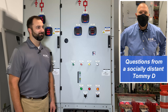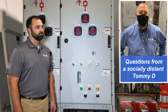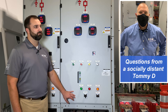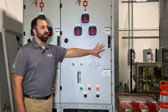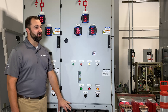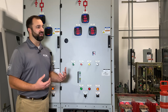We talked about the doors, the entry and exits. The doors down on the bottom of this equipment are open right now. The door that's up top — is it interlocked? The low voltage door up here can be key locked right here. There are no interlocks installed on this door. The cable compartment access door below is a bolt-on cover, so that does require a physical act — there are many bolts to remove from a safety standpoint.